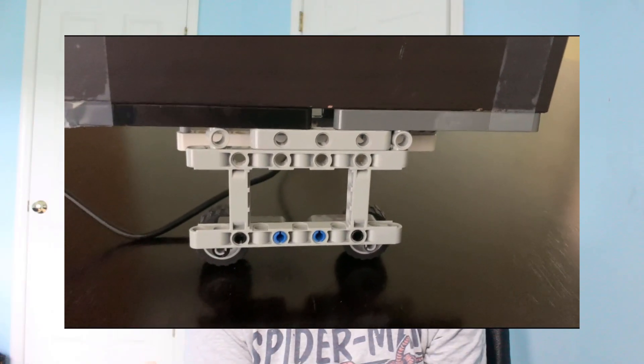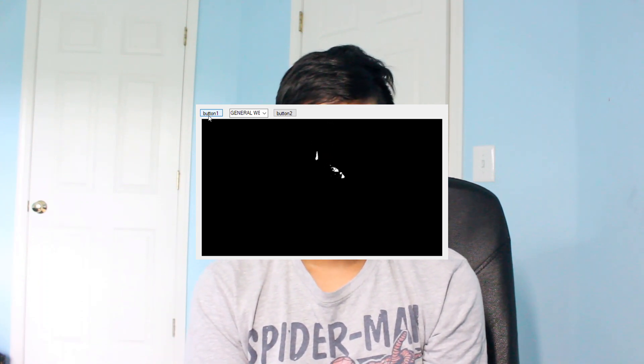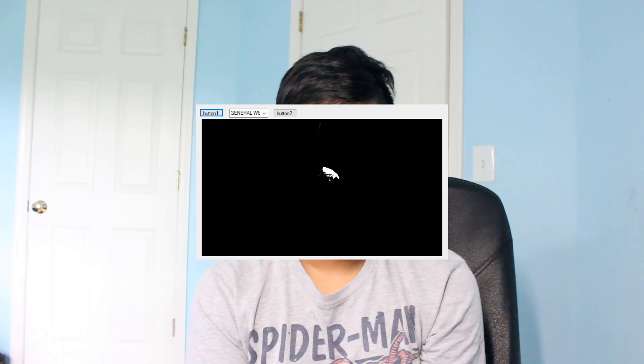Alright, so the building was really simple — just two motor thingies and two roller thingies on the legs of the table, and then a USB webcam for the vision. The tracking was pretty fun. I basically used a very similar algorithm to my air hockey robot. The program searches for the white pixels in each frame of the video and then identifies little blobs of pixels. It finds the position and the size of the largest such blob, and this is all written in C#.